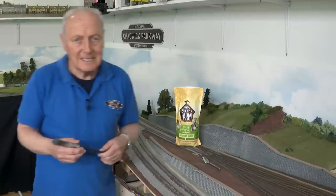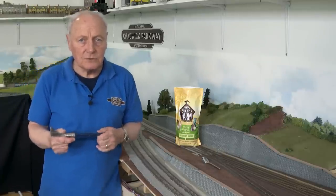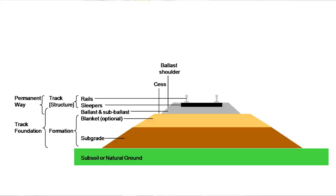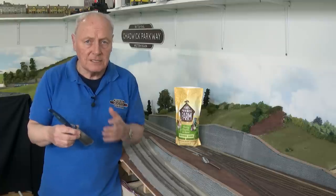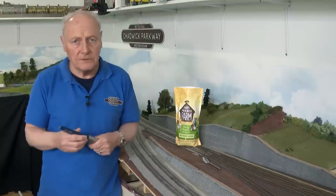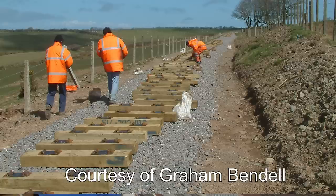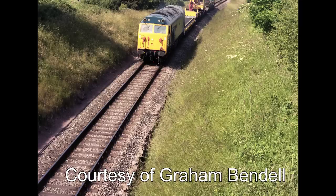Earlier I mentioned something called a CESS — pronounced C-E-S-S — and from this image you can see it's formed from a substructure of your basic railway. The CESS tends to be a safe area for permanent way staff to stand whilst trains go trundling by. In good condition it's made of finer gravel. There are a few images here from a good friend Graham showing the CESS or where it used to be — as ballast builds up, the CESS gets lower and disappears into the undergrowth.